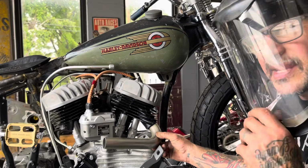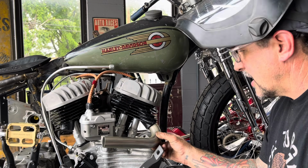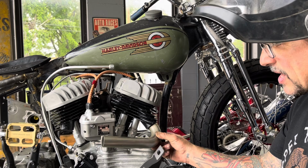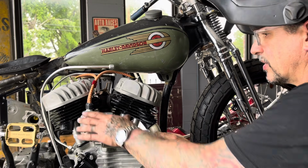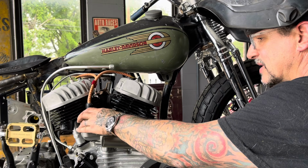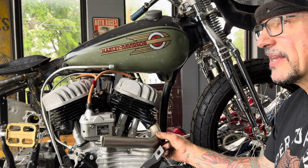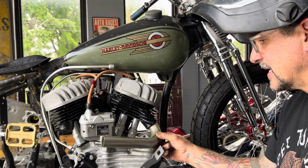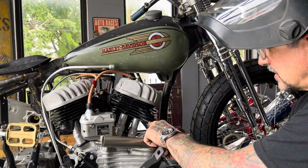So there's my first cut coming off the head. You can see it gives me room to get into my brake pedal if I need it. It's got me coming a little bit outboard of the Magneto, a little bit of swing for the mag for advance and retard. I usually set those mags pretty close to full advance for racing. You definitely don't want to run it retarded for racing. It'll overheat the engine and lose power. So I've got that one kind of set up.